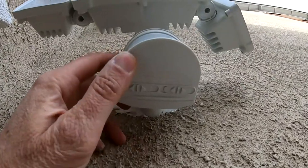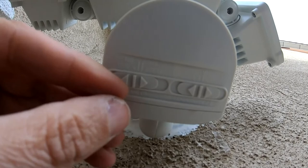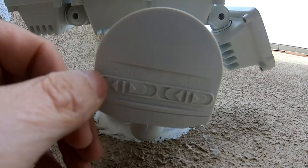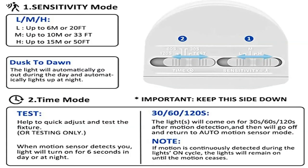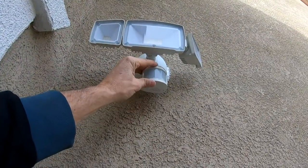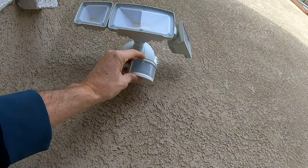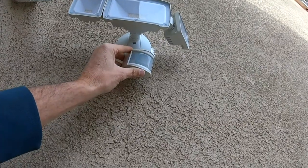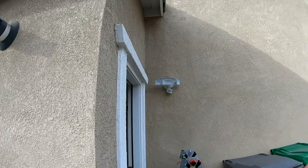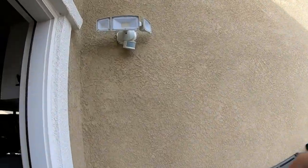On the bottom there are settings. The left side switches let you choose how long the light will stay on once triggered: 30, 60, or 120 seconds. Test mode lets you quickly test the motion sensor — the light will go on for 6 seconds. To the right is the sensitivity setting: low detects 20 feet from the sensor, medium 33 feet, and high 50 feet. The light also has adjustments to loosen and tighten the angle, with small notches to help it grip once tight. This sensor detects a 180-degree radius. I have a wall in the way, but I can get this long area covered. I'm going to switch it to high to cover as far as I can.